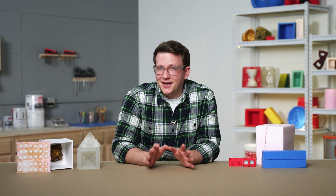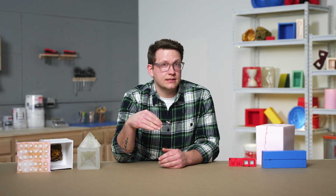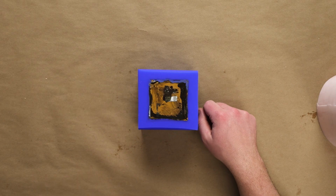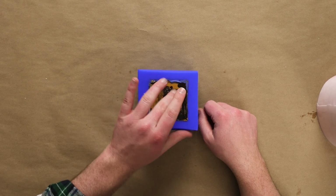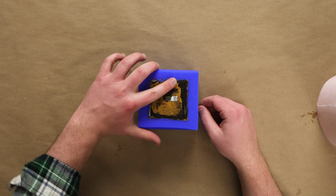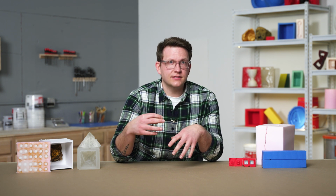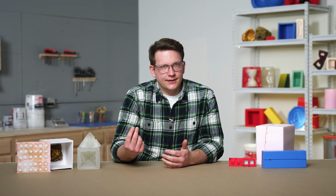Before we just start cutting away, let's look at the base of our master and determine how thick the silicone that leaked underneath is. If the silicone flashing is extremely thin, then we may only need to gently peel away the thin flashing since it won't have a significant amount of hold. If our silicone flashing is too thick for this, then we'll need to grab our X-Acto knife.